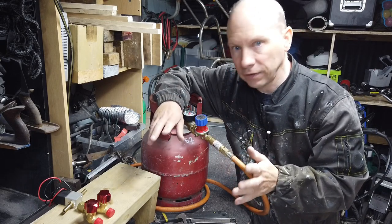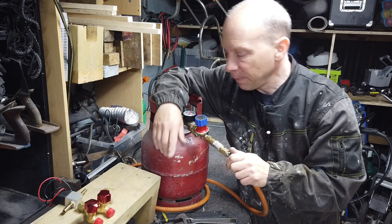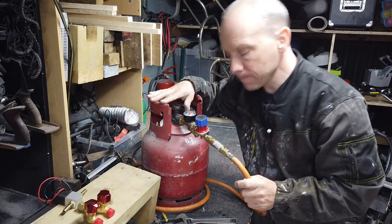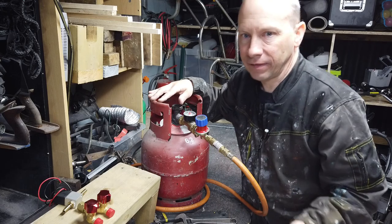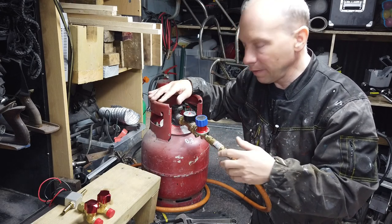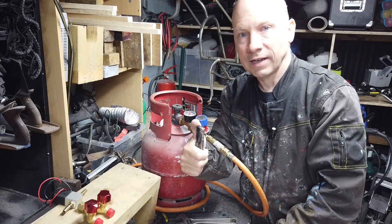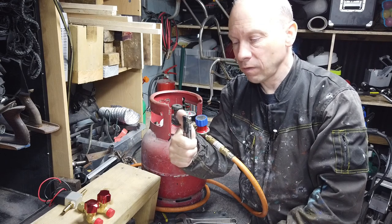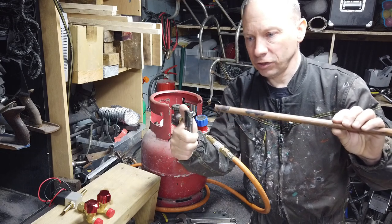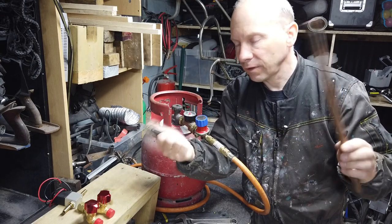Now, probably the hardest thing of all — setting fire to the gas. You might think setting fire to propane is actually very easy. It's actually quite difficult. The gas coming out of the cylinder is coming out under high pressure. The thing with high-pressure gas is it's quite a powerful jet, quite a powerful stream, and generally what it does is it blows out most ignition sources. So for example, if we took a little lighter and lit it, it's very easy for the gas to blow the flame out. So imagine if you just had a lighter at the end of your ignition tube — as soon as the gas is propelled from here, it just blows the flame out. You've got to overcome this problem.